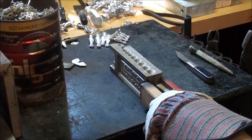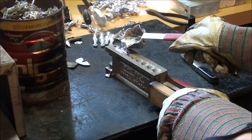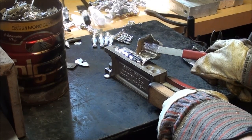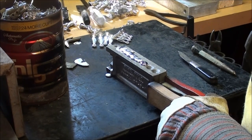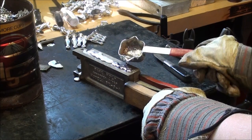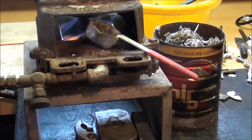You hold the mold together by its wooden handles and use the same little ladle. Metal is coming out on all sides — tip your ladle a little, Jordan, so it's just coming out of the spout. There are no fine details or skinny parts on this sinker mold, so there's greater success with it. Plus you can use sinkers for fishing, which we like to do. He keeps his ladle right on the edge of the fire so it stays hot.